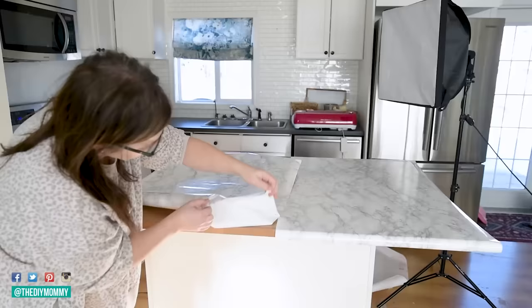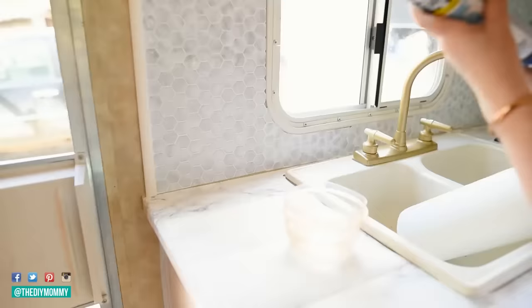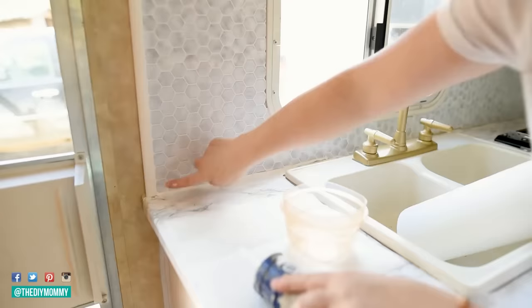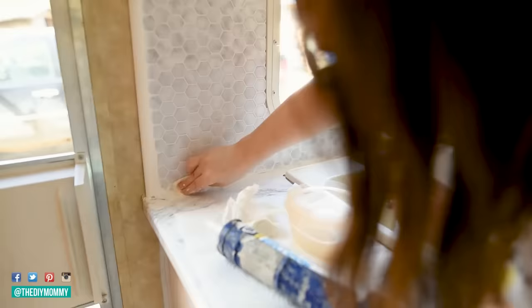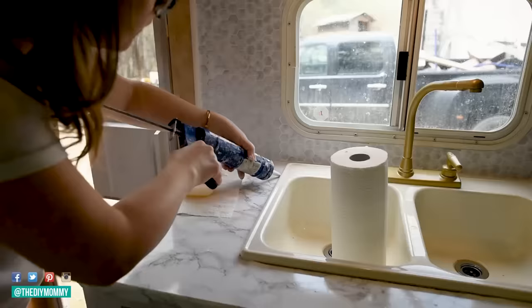I feel that method gives me a pretty nice edge on my corners. As far as seams go in the contact paper, you will probably have seams in your installation because there are only certain sizes of contact paper you can buy. Just make sure to butt the contact paper up together rather than overlapping it — that's going to give you a more even finish and it's also going to wear better because it won't have any lifting where things are overlapping. You can buy quite wide or narrow versions of this DC Fix. For this island I just used two wide pieces. Another thing you can do to make contact paper countertops look professional and stay sealed is put a little bead of caulking along where the counter meets your wall, and also around the sink. I just use latex caulking, but you could use silicone around the sink — and that's going to give it a finished look and keep it from peeling up in those spots.